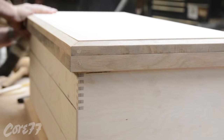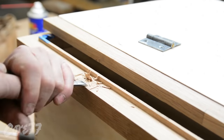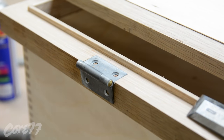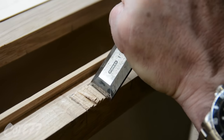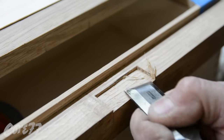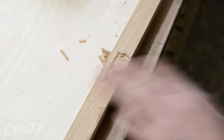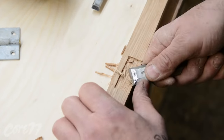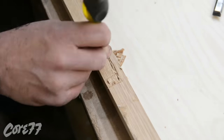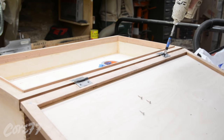Sanding it. That's white oak, thick white oak, about 1⅛ inch thick. Now I'm making my pockets for the hinges. Doing this is always difficult, but it helps when you break the grain up into small tiny pieces. These are hinges I found at an old garage sale a long time ago. When you break the grain up into tiny little pieces it does exactly what you need — then you just trim the bottom flat. I'm using a center drill to drill the center hole right in the hinge, which is designed to center the hole inside the hinge hole.